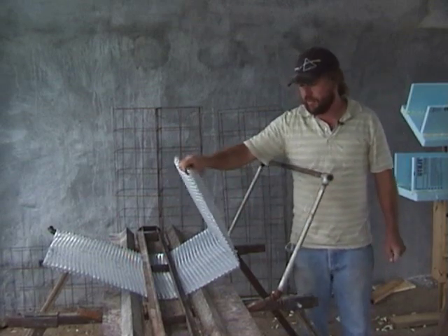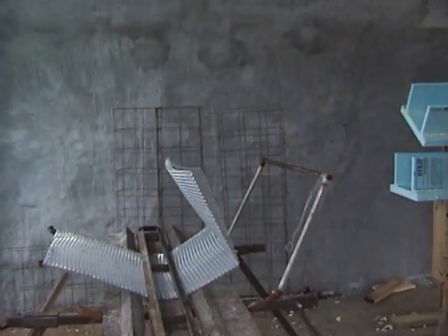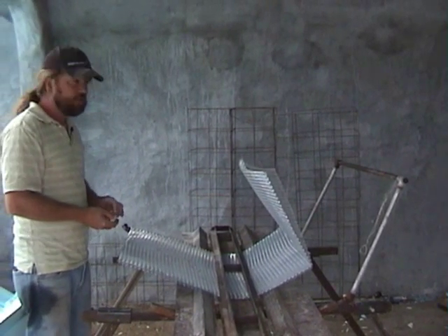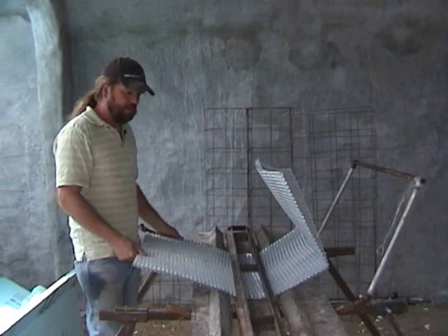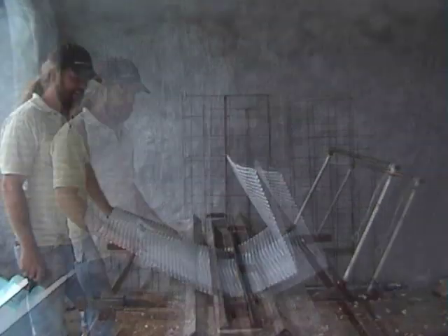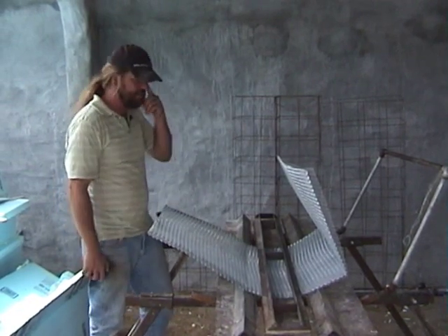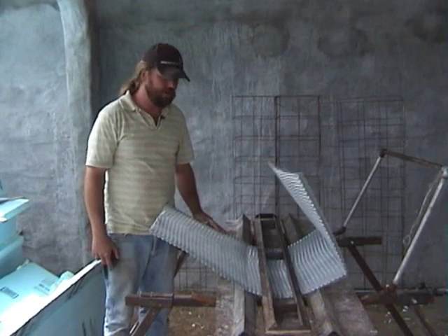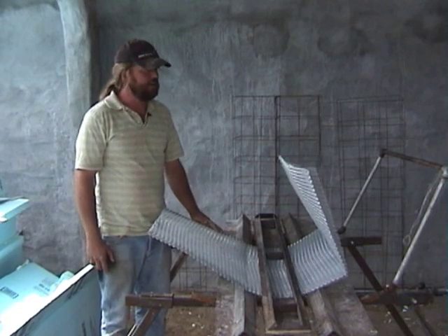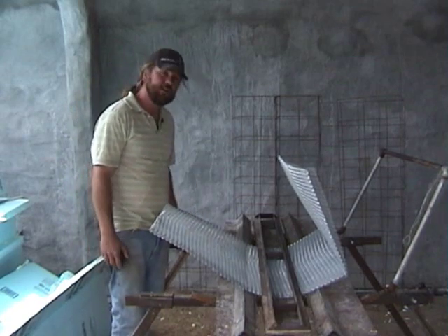Back to the foundation design — we're trying something new here, trying to fold our metal lath straight so that we can fit it inside of these styrofoam forms to get ready for the plaster. We're going to prepare a bunch of this metal lath for the laminated technique. We're in the process of trying out our very first fold, making sure we get them square and the measurements right, so they're ready to go as we plaster that foundation beam. We think we can do that 180 feet of foundation in two days, which would be pretty good for two guys.